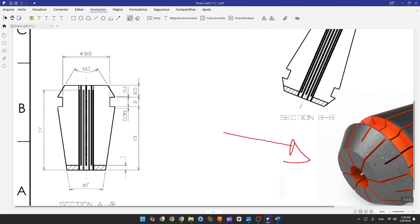Now we'll make this sketch step by step. We have our midline — the construction line. We'll make this line, this one, and here. At this point we have a line. The distance of this line is 0.1 millimeters. The distance between this point and this point is 2.5 millimeters. The angle between this line and the construction line is 30 degrees.